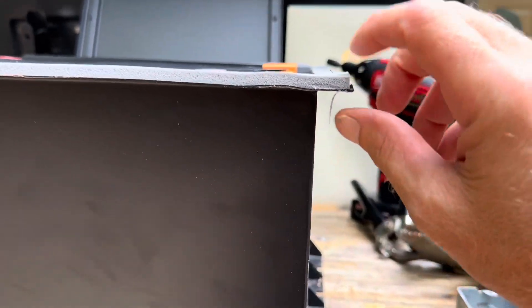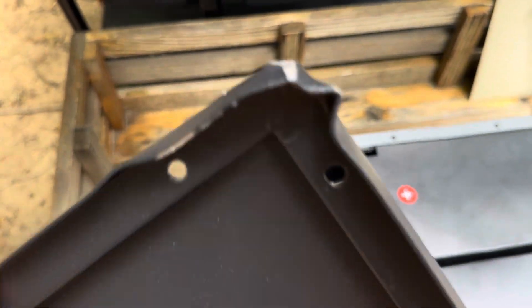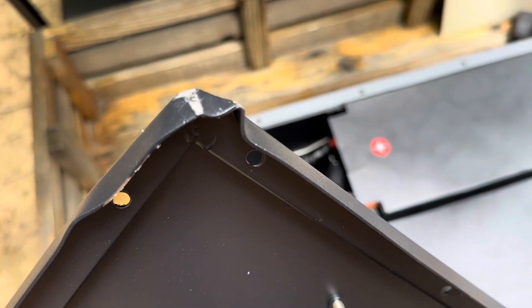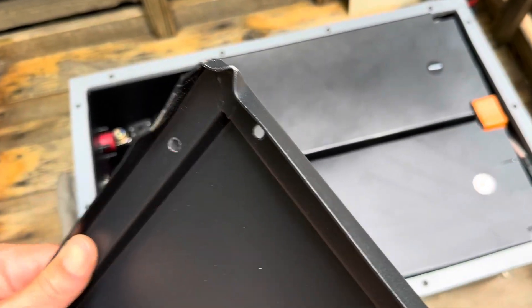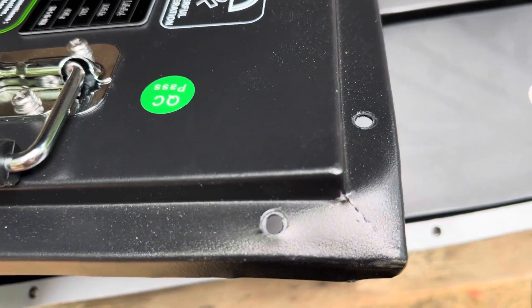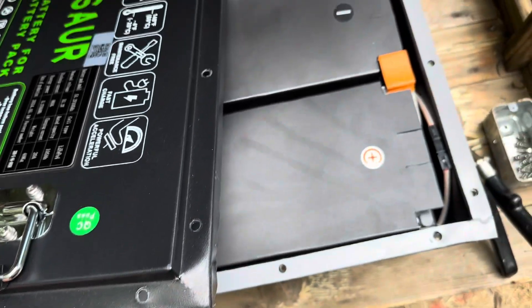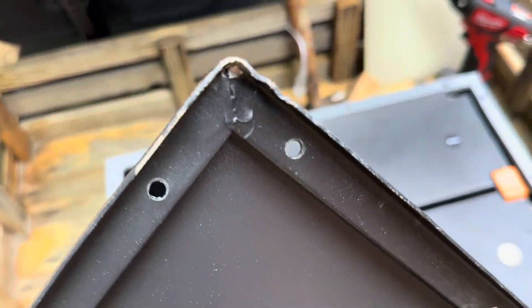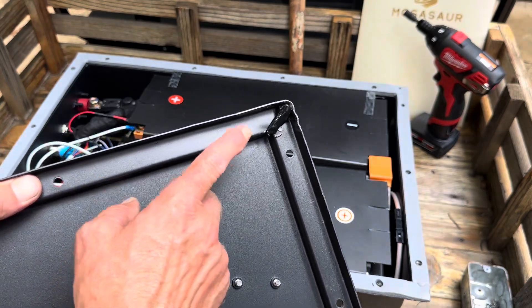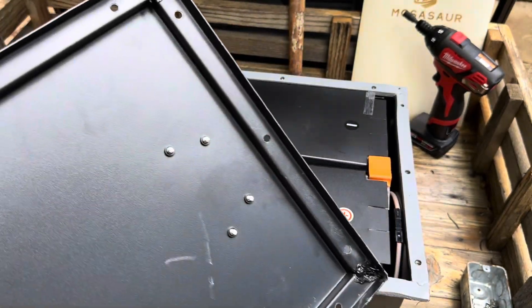I got it straightened up fairly decent. Got that nice thick gasket, so I'm going to let it ride right there. Now I've got to work on the top cover and get it fixed up — should be in good shape. Here's the outer cover; that's why it was hanging up trying to get it off. I don't know which corner took the hit or if they hit both corners. When you see your tracking information say that your label's been defaced on your outer packaging, well, that's probably why — probably because they Hulk smashed it. I can't believe this battery took that big of a hit and still good on the inside. It busted the welds out in the corners of the cover — that's how hard that thing hit. The pack inside was unscathed. I got all the bend out of it using a block of wood and turning tongs without splitting the weld anymore. The two corners I worked on and the one with the split weld — I just threw some polyurethane sealant on there to maintain its seal integrity on those gaskets. So the cover should drop right back on.